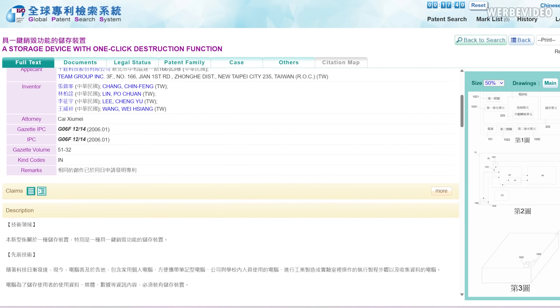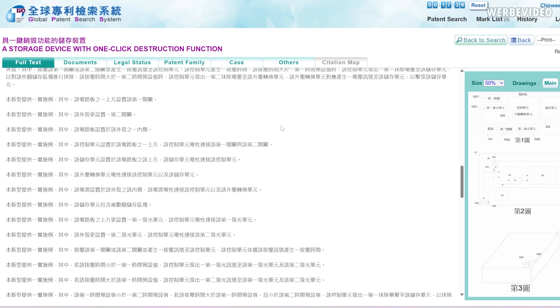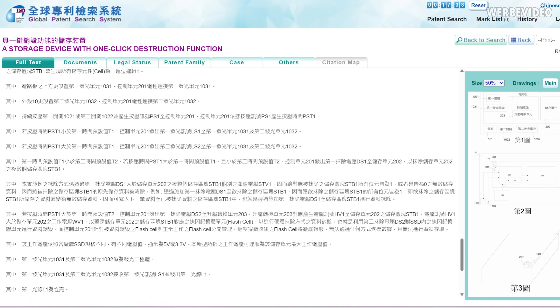The patent number is M662727. I went to the Taiwan patent office, translated it with ChatGPT from Chinese to English, and found a quite good description of how the technology works. It's a two-step erasing process: if you press the button briefly, the software does a normal erase. But if you hold the button longer, a DC-to-DC voltage booster kicks in. They don't state the exact voltage, but the default is probably 3.3 or 5 volts, and it likely boosts to something like 10, 15, or 20 volts or more — way too high for the flash memory to handle, killing it by overvolting.